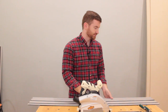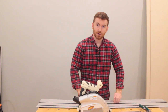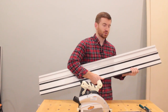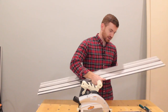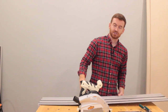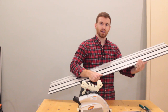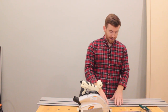The track on the bottom has what feels like foam, and it does a pretty good job of sticking down. I usually just lay it on the plywood, get my mark, and pass it along. The track originally when you get it — the rubber strip on it is oversized. On your first ever cut, it's going to cut this rubber down to the size it needs to be. What that does is it puts pressure on whatever you're cutting with this rubber, holds it down while the blade is coming up, and it eliminates chip-out on one side of the workpiece.